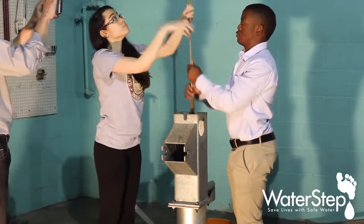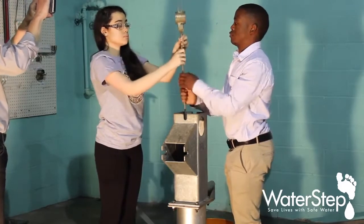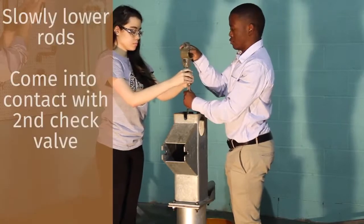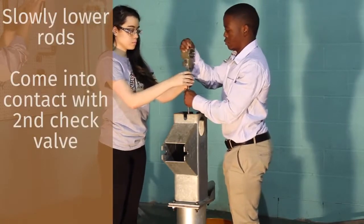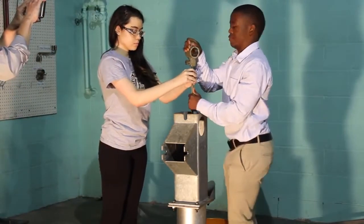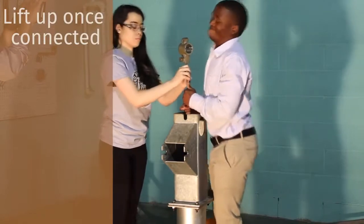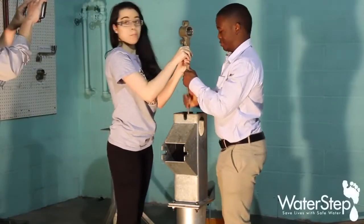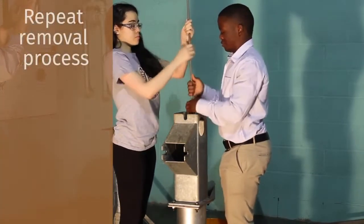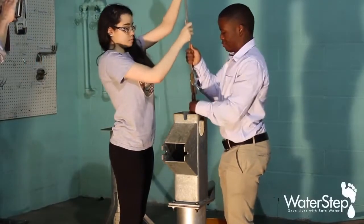As you put the pieces together and slowly lower them, you will come in contact with the loop that is on the top of the bottom check valve. It may not line up exactly right when you first go down, so you may need to rotate the sucker rods a little bit until you feel it drop into the loop and capture that loop. As you put the last sucker rod on, slowly lower it until you feel it come into contact with that lower check valve. Then rotate it a little bit, lift up, and you will know that you have caught it. You have to kind of pop it up and pull it up, then do the same process as before — both people putting their hands on — and bring it all the way up until you clear the cylinders.